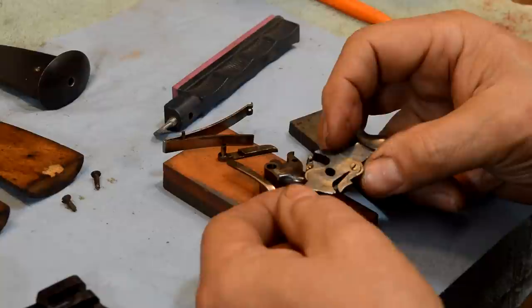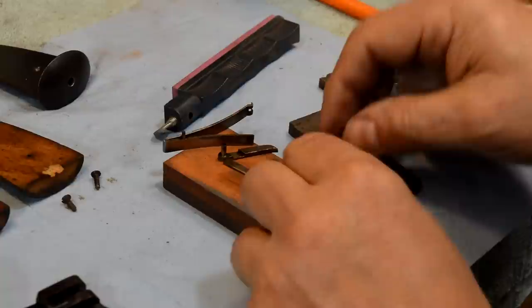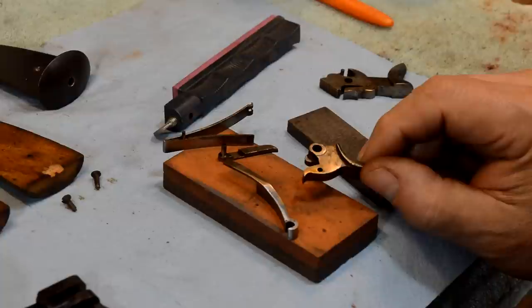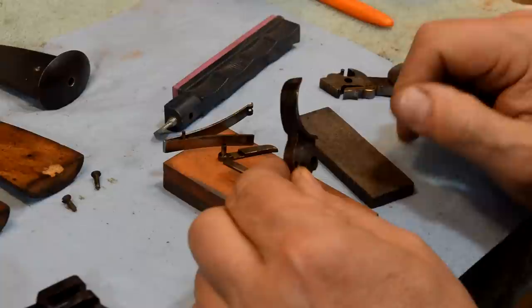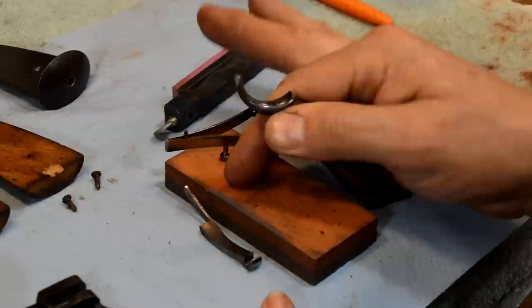This hammer's actually in pretty good shape. See the yellow color? That yellowish color on this trigger and hammer means all of this, just like the wear parts on a Luger, was tempered to a very hard - almost file hardness. We're going to have to put heat on this trigger in order to bend the nose of this thing over to make it fit inside the trigger guard. We know that because there's a big shiny spot right here where it was touching. We've got to make sure we keep all of this cool underneath the critical wear surfaces.